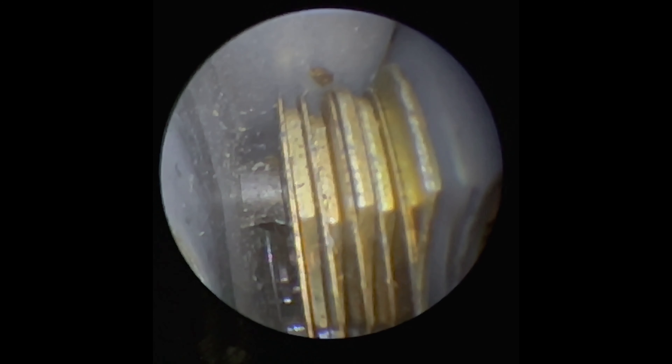One is absolutely solid so I'm going to gently nudge one until it goes up. It's gone up - it feels like it might have gone too high, but no, there we go. The curtain is rotating on the left-hand corner and the bolt is obviously being withdrawn as it rotates around. If you look at the tops of the levers now you can see they're virtually forming the pattern that you would get on the bitting of the key. We'll do one more pick and this time it will be a more conventional view from the front.